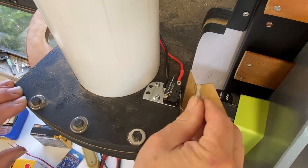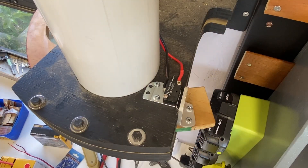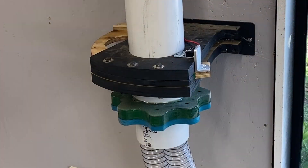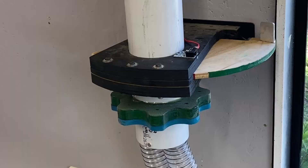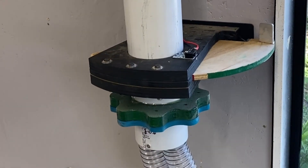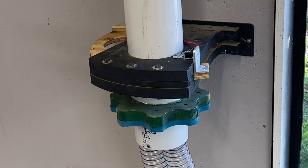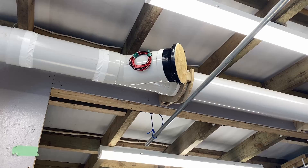Here is a bit of a top view of what we've done and we're going to test it out. That runs the dust extractor nicely and then we can turn it off by closing the blast gate. Off camera I've done exactly the same on my second blast gate for the mitre saw and we're going to test that as well — it works really well and there is a lot of suction. This works absolutely fantastic. When it's time to shut it down, just close the blast gate. Now I have a few more of these micro switches to add but I haven't finished the plumbing and the other bits. In the corner here this is going to be a floor sweep so I need to put a blast gate in here and make up the floor sweep — that'll be in another video. There is this Y at the top which needs to go over to the lathe for when I'm sanding, and again another blast gate is required.